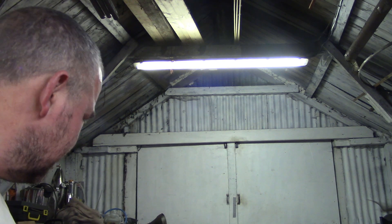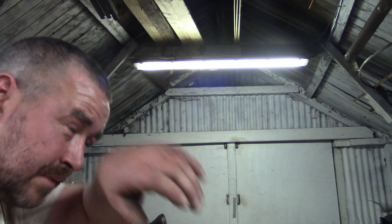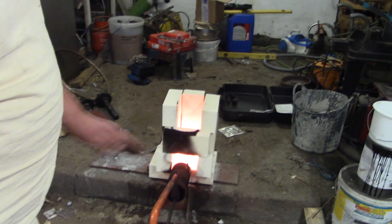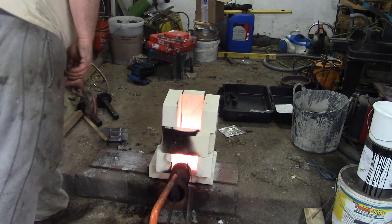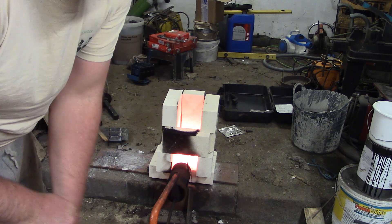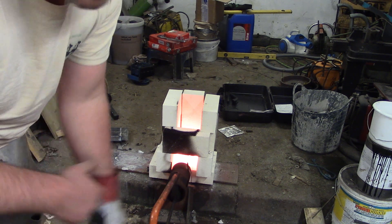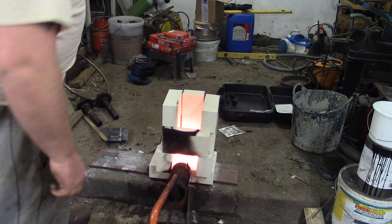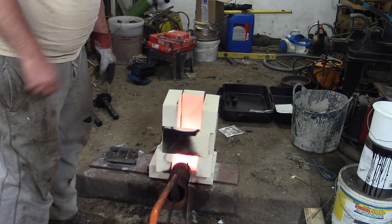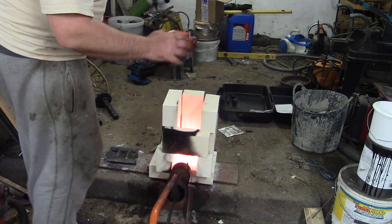I don't think we've actually got a complete melt here. I kind of feel like for this to work, we need forced air to give it a hotter burn. It should be possible - if you can do it with waste engine oil, we should be able to do it with kerosene. It's been in the same state for about five minutes now. It started melting after five minutes, I added more metal, it took another five minutes to get molten again, and then it's been at it another five minutes since then. What I'm noticing is it's not doing anything more now, and I can feel bits that aren't melted - it's sort of crusty.